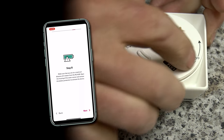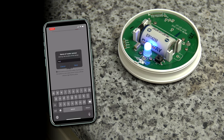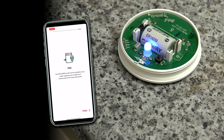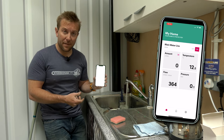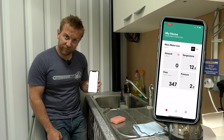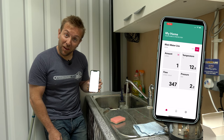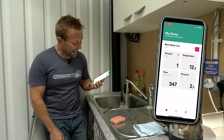After the connection is established, we have the option to add a water sensor. Unscrew the back of the sensor, remove the battery tab, then press down the button until the LED light flashes blue. Press next on the app and the hub and water sensor will automatically make a connection. You can rename the water sensor for where you're going to put it - I'm going to shove this under the studio kitchenette sink. This is a really handy feature because you can have up to five sensors on one hub. Now I've got the app - do you want me to turn the water off? Just click on this - and there's the water off. Turn it on again. Look at that - how cool is that!